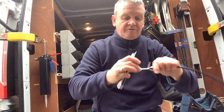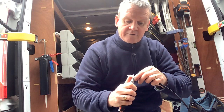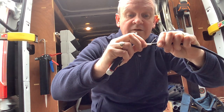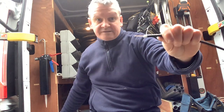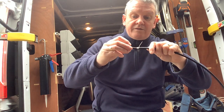Then you can just trim the foil back and trim the foam down to the conductor — maybe again about five millimeters. Once we've got it like that, all we need to do is thread the F connector on.